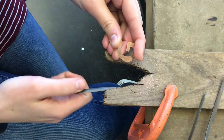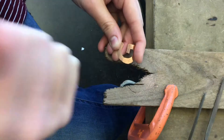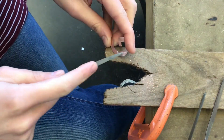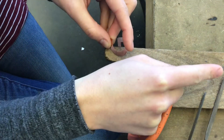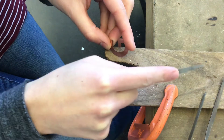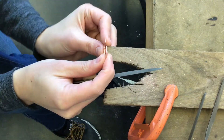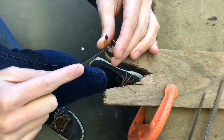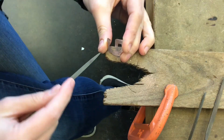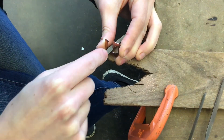Filing is a little different than sawing. Sawing is an up-and-down motion that technically only cuts on the pull-down motion. When I'm filing, it's only going to remove material as I push away from myself — it's not a sawing motion, it's a push, a push, a push. Only as I push away from myself is it removing material.